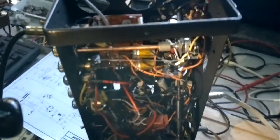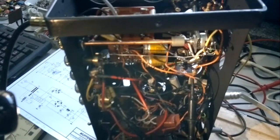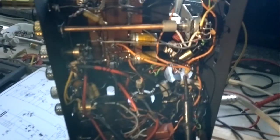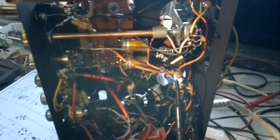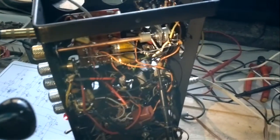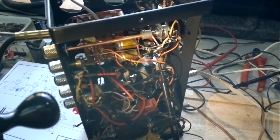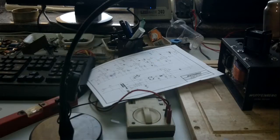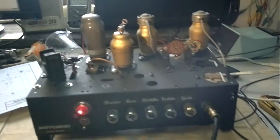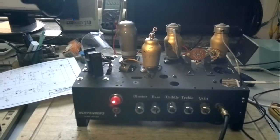The hum is a little bit reduced now. I also worked on the grounding concept of the amplifier, trying to improve what you could call a distributed star ground. That's still not final, but just to give you an idea how this amplifier sounds — I'm really happy with it now because all the muddiness is gone. Let me put my camera on the tripod and then riff a bit.